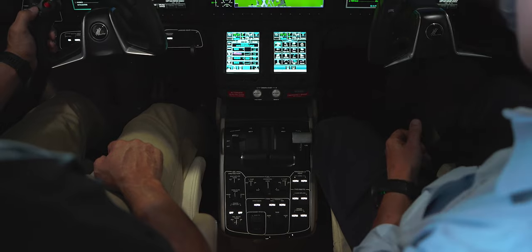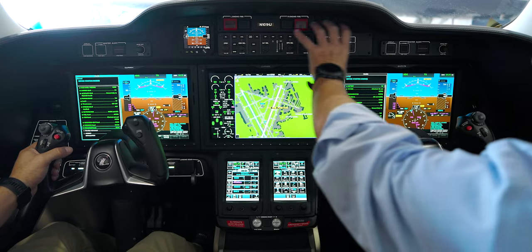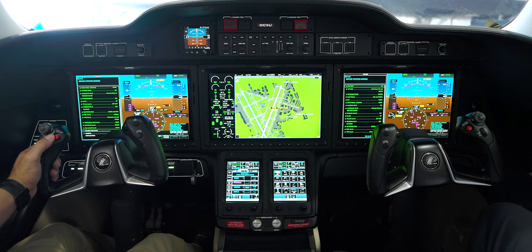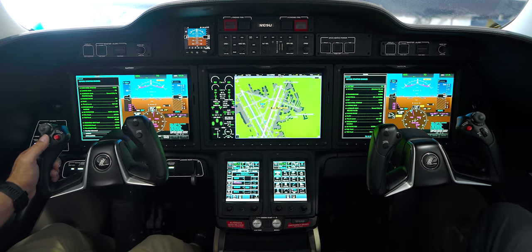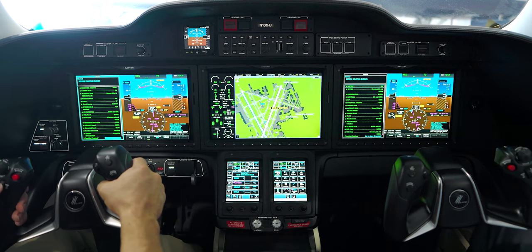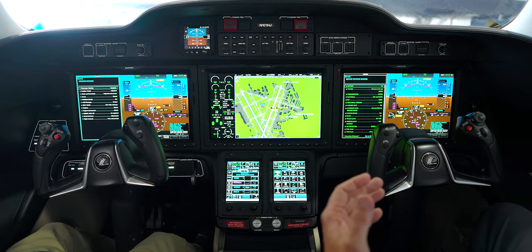There are no boots — everything is hot wing and an electromechanical thermo device on the tail. It's all electric heat rather than boots. Glare shield panels are all up here — reversion modes and so forth are where they should be. Nothing's in an off mode like a pitch trim servo or in a reversionary mode; everything is in normal auto mode. Standby instruments all good, altimeter set. Avionics system checks are complete — flight plan loaded, takeoff data loaded.